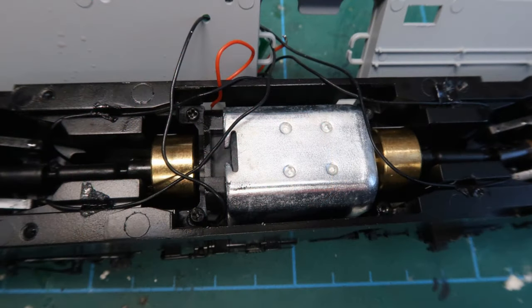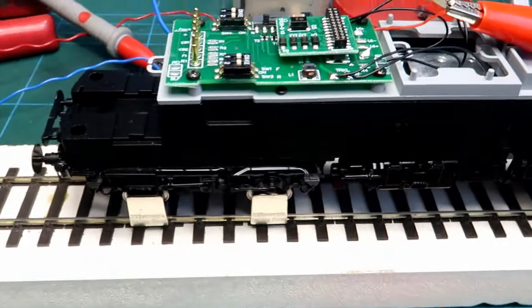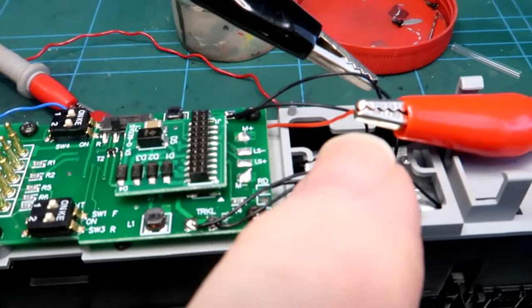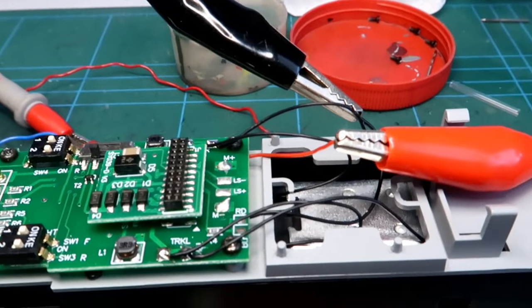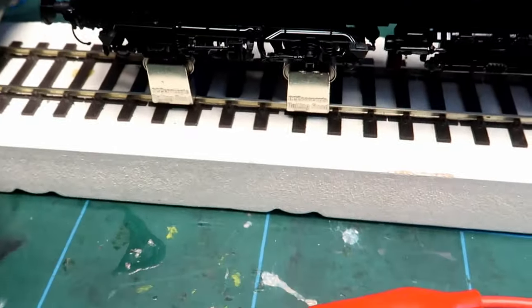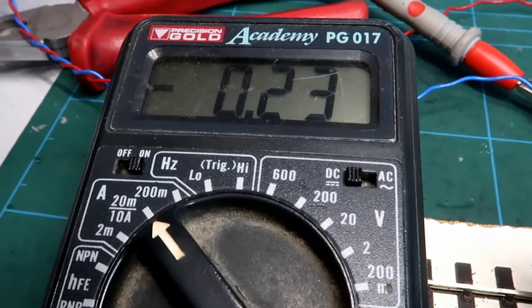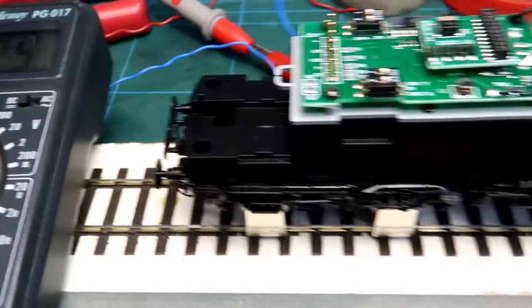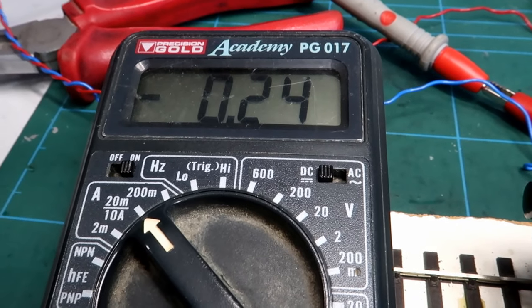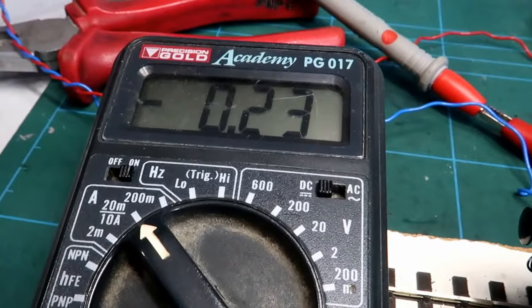Let's start our investigation. The lid is open and I have the current meter on it. I've disconnected the motor from the PCB and am feeding it directly, so whilst she's on the rolling road there are no connections to the rolling road — feeding the motor directly. This takes everything possible out of circuit from the board in case anything there is causing the sudden rise in current. At the moment she's drawing what I would expect, but it's a bit high for a light loco. She's on her rolling road so I suppose that could give a bit more stiffness. I'm going to let it run and see if we get the sudden increase in current.